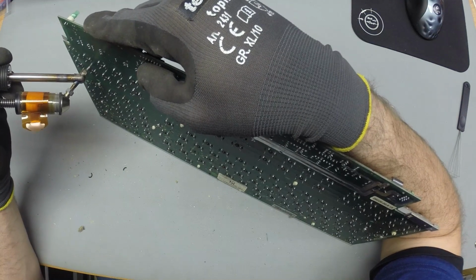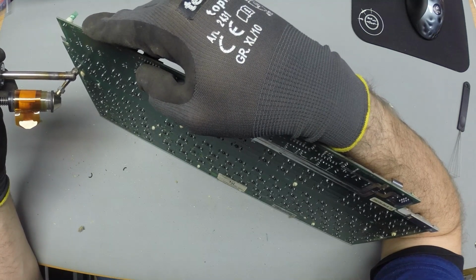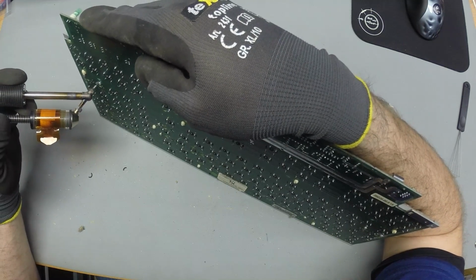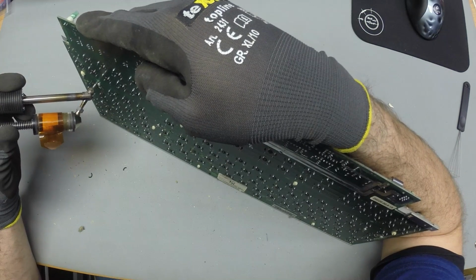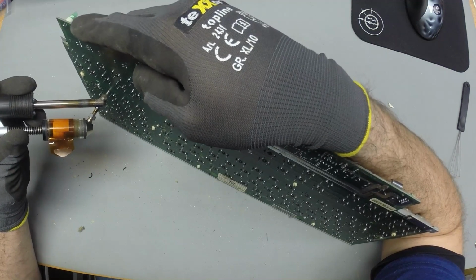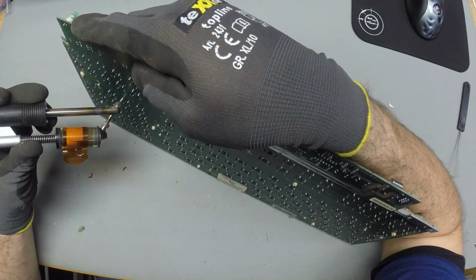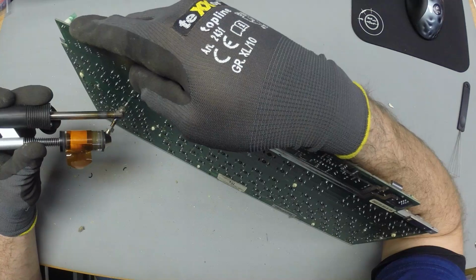So the best way I figured was to keep the compressor running, like just use the air until the compressor turns on, and then wait a moment for it to refill, and then immediately start, like before it even finished refilling, start using the compressed air again, and kind of keep using it while the compressor is running. So if you balance that out well during sandblasting, you can keep the compressor running permanently, and you don't have these cycles of building up the pressure, depleting the pressure, building up the pressure, depleting the pressure, and instead you can just keep the compressor running and not waste so much time, like be a lot more efficient.